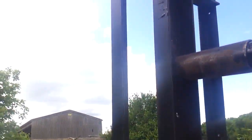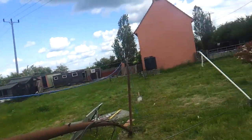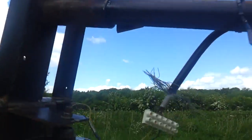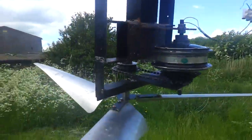Hopefully it'll take some speed out of the blades. I've got this bit of rope, which is very important — it's connected to the front of the turbine. Basically I can use this if I get a serious problem to move the tail out of the wind, and then as long as I join the two power cables down there together, that'll stop everything.